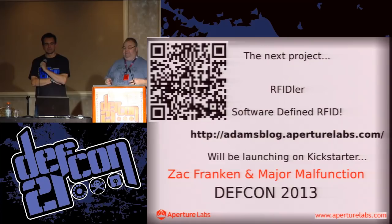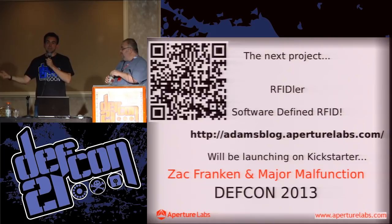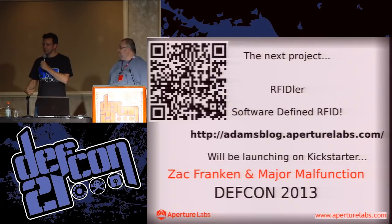On a related note, we've used the Decapinator to drill a hole, and then his very precious microprobes to selectively break wires and then probe on and actually feed our own data in instead of what was supposed to be coming from the other guy. We're all about getting this into the back room economy, so you can do this yourselves. Where would we have got the thing that sends the data into these probed devices, do you think? Not eBay, no. We got it from SparkFun, and it cost about £30, and it was called a Bus Pirate.